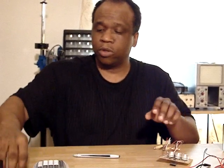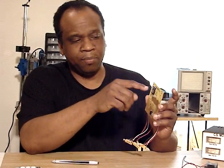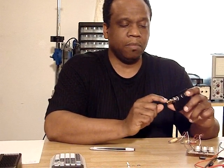One thing I should mention is that we have this insulator here that will be in between the MOSFET and the chassis, because the metal portion at the bottom is actually the drain and you don't want that to come in contact with the chassis. This is the backplate — here is where the positive from the battery and positive from the cell will make their connection. Both are connected here because this is basically a piece of brass threaded rod that's been bent, and I'm going to use this as a shunt for the amp meter that will be built into this pulse width modulator.